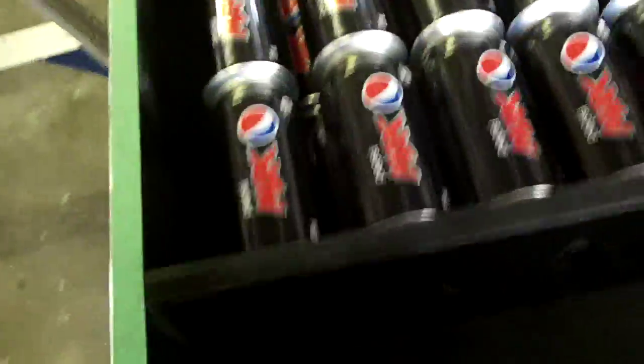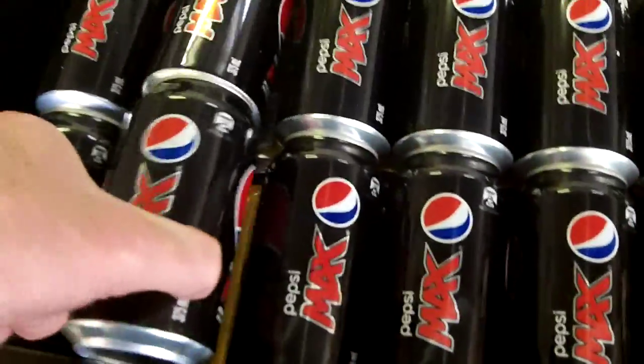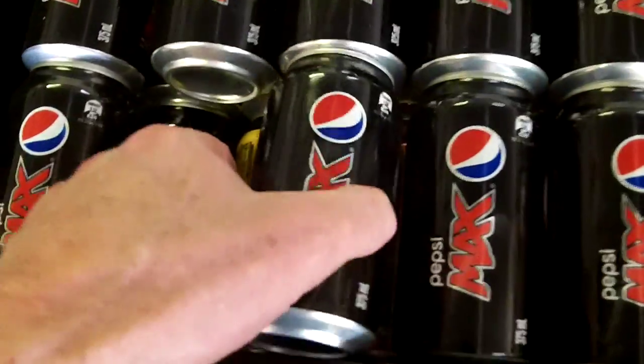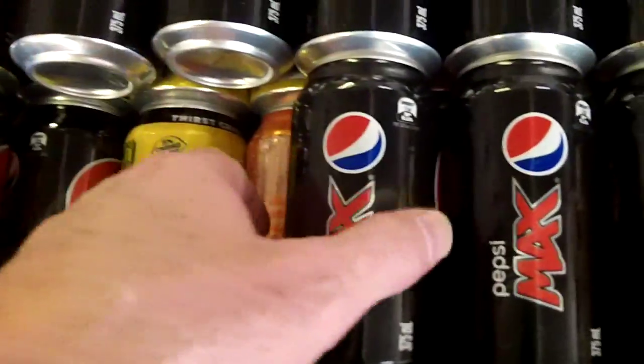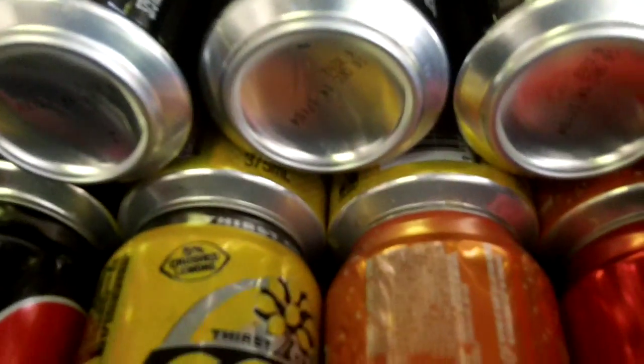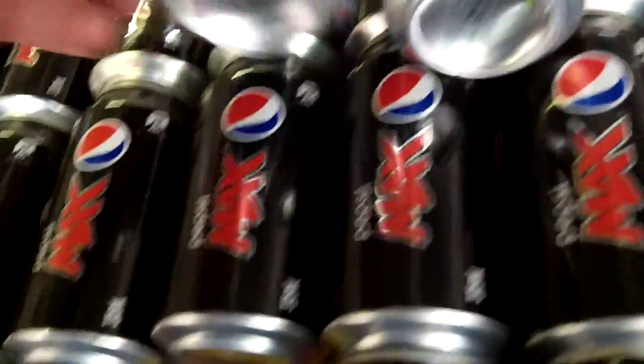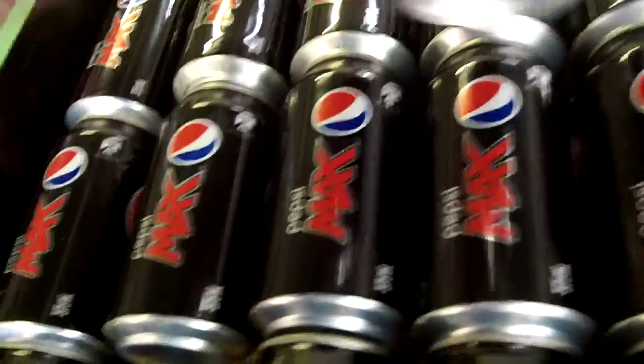How my idea works is this: I've got a standard box with two layers of cans. The top layer is black cans, and the bottom layer is different coloured cans. In between the cans there are different layers, and that is where the air will actually flow through — through this manifold here. You can see it right here; there's a little air gap just there, that's where the air will go up to the top — in between the cans, not through the cans.